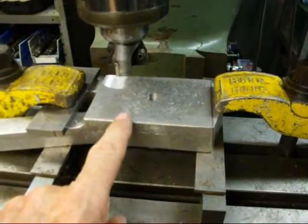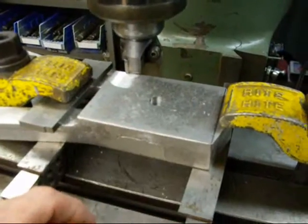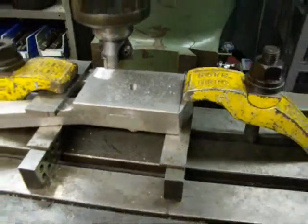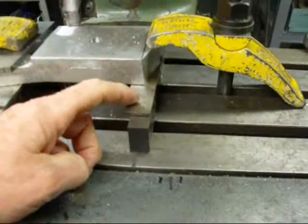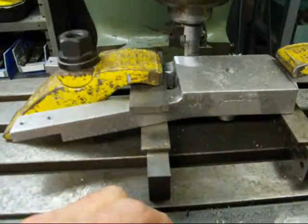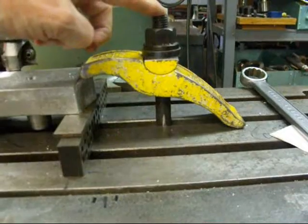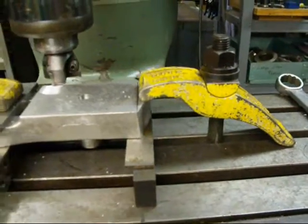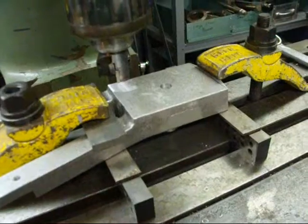This is the surface that the cylinder oscillates on, so it needs to be true. I've got about an inch-and-a-half cutter here and I'm going to take a couple of passes off that — take off as little as possible, but get it trued up as best I can. Notice the setup: I'm on a couple of parallels because of this hub down here. When you make a setup like this, always make sure your parallels or packing is directly underneath where you're clamping, so the work does not flex. Also try to always get your T-bolts in a perfectly vertical position, not cocked. You don't need to over-tighten this on a light cut — if you over-tighten it you just get yourself into trouble, but you do not want it to come loose either.